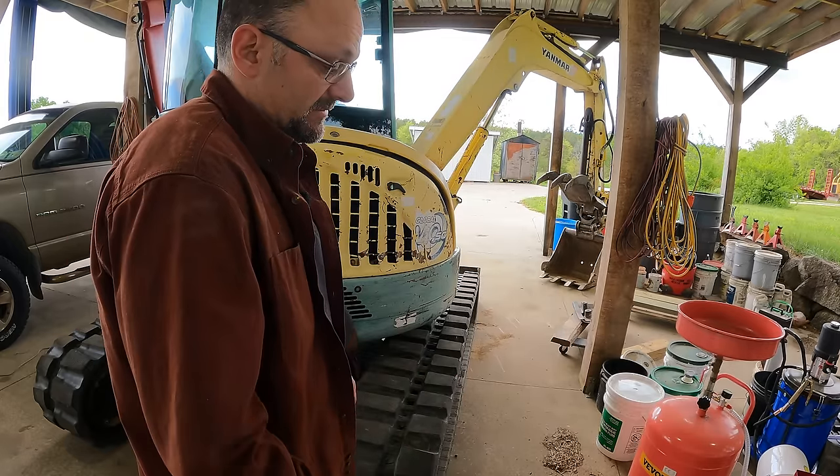My conclusion is I have wear in multiple different parts of the machine. I probably have a slightly slow travel motor, a slightly worn control valve, and a slightly worn pump that, the three together, make trying to pinpoint it to one thing basically impossible. But the pumps are probably the worst part of the equation, because when I flipped them it did flip the problem to the right, though not as bad. So the internal leakage of that bad pump was offset by the internal leakage of the valve and or motor on the opposite side, which straightened me out a little bit.